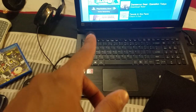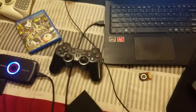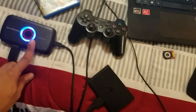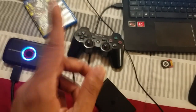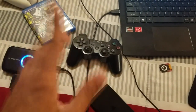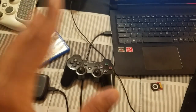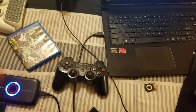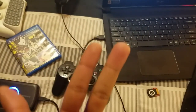Capture footage from your PlayStation TV. Now before you go and just straight up plug in your PlayStation TV into your Avermedia Capture Card, do not do this. Because there is a thing that Sony made called the HDCP, which stands for High Bandwidth Digital Content Protection, which is hooked up and locked out for PS3, PS Vita TV, and even PS4.